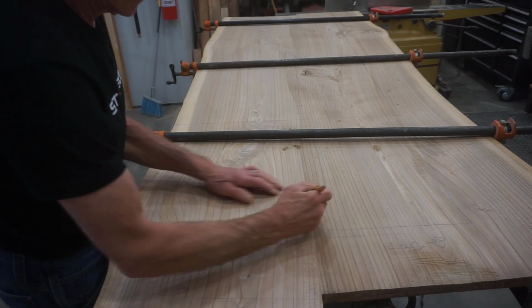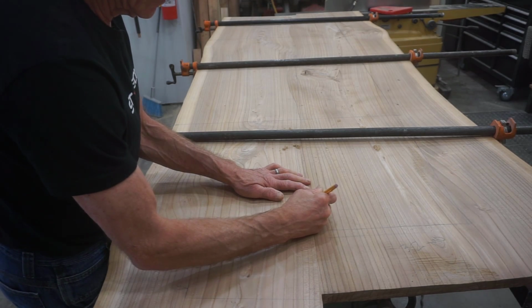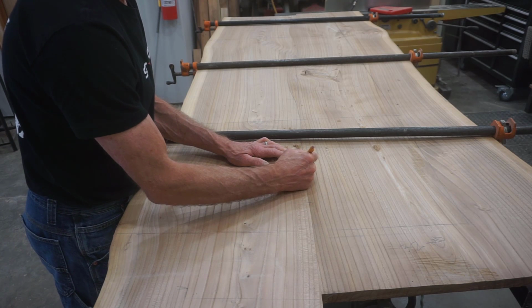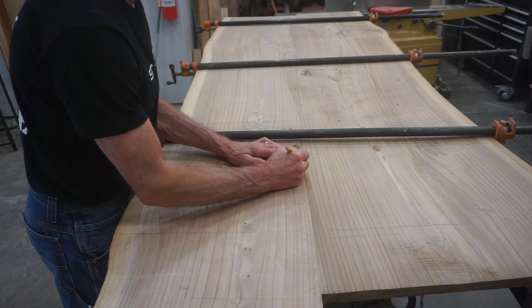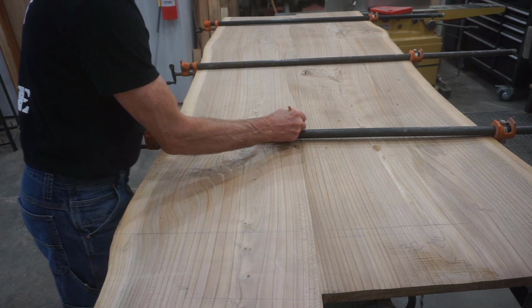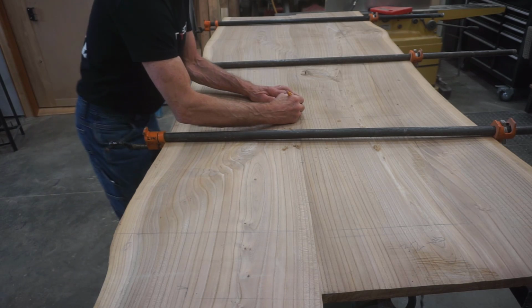It did take me a bit of time to position these slabs next to each other to minimize the gap between the pieces. And I want to preserve that alignment when I go for the final clamping during glue up. So I'll add small tick marks along the joint that will help with alignment. I'll also use the tick marks to plunge a few biscuits into this joint.